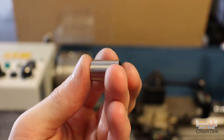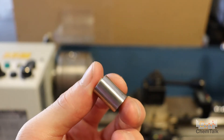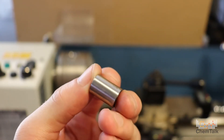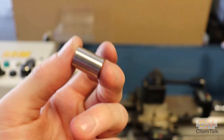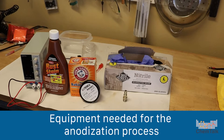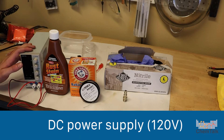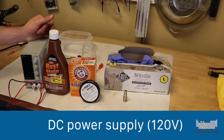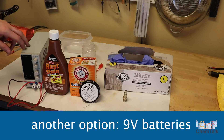Now we have what appears to be an acceptable surface finish on our part. It's not perfect — there's a few imperfections — but for the sake of this video it's pretty good and it'll get the point across. So if you want to do a good job, make sure you spend time prepping the part. Let me walk you through what we have here for the anodization process. The most important thing is going to be your power supply right here. Ideally you want one that can go to 120 volts so you can get the full color spectrum from pink all the way to lime green.